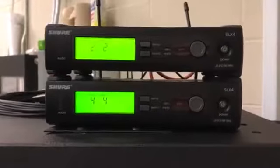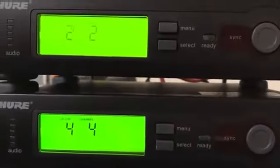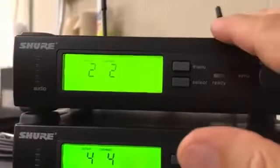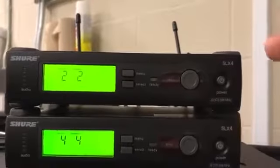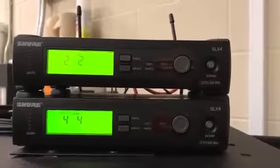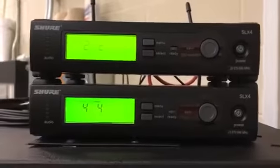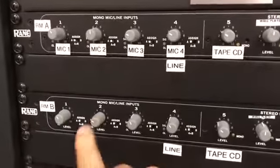On the top of the rack are wireless receivers. The microphone is a transmitter and transmits to these boxes; each has a designated frequency and group. The wireless handheld microphone comes in here. For an event with two handhelds or a handheld and a lapel mic, you'd have two wireless receivers. If the event is in rooms A and B, you can route wireless mic input into room B and room A accordingly.